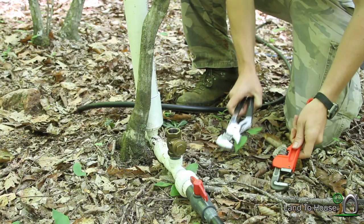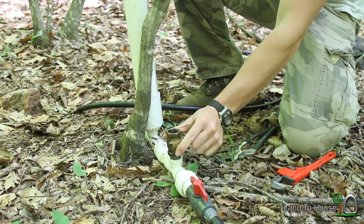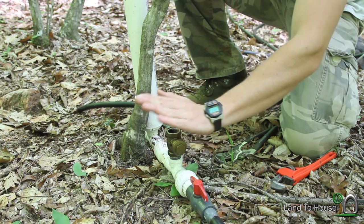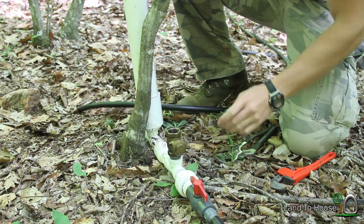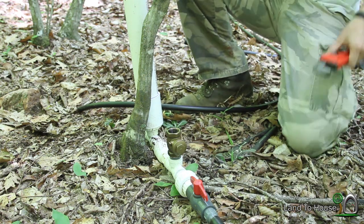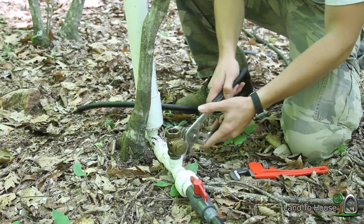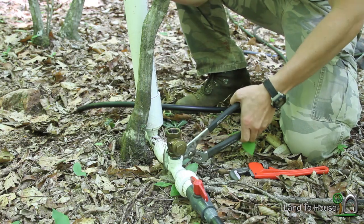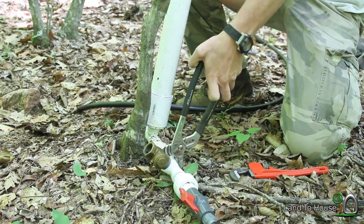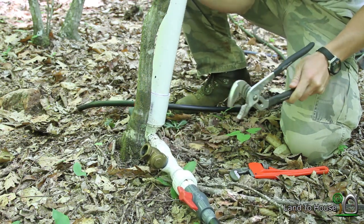To make our pump use less gallons per minute, what we're going to do is angle the check valve to the side, and then drop the angle more toward the ground, so the water has less pressure to close that valve. Now, what I'd like to do is see if there is much difference in the efficiency once we do that. We're going to try close to a 45-degree angle here.